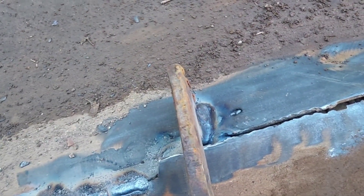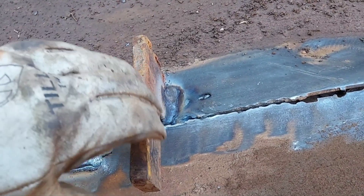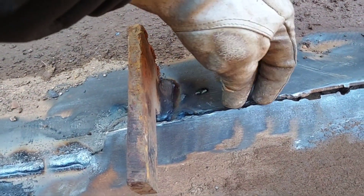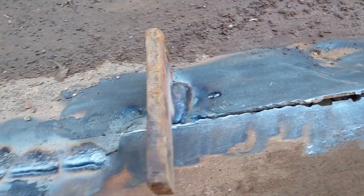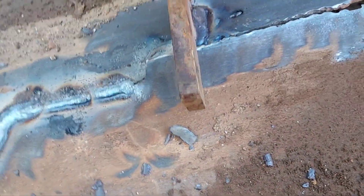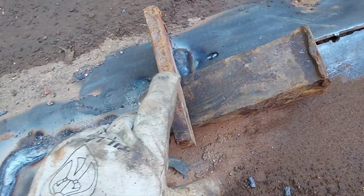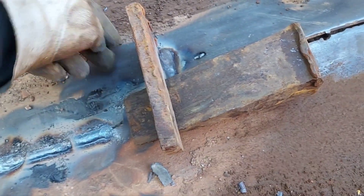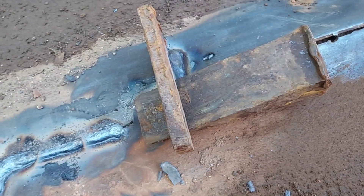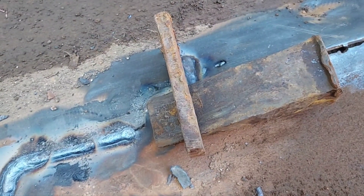You might have been wondering what the dog and the wedge was all about. The dog goes there. That piece of plate is lower than this piece of plate because of this giant dent right here that you can't really see on camera. What you do is weld the dog to the lower plate, then stick the wedge in that gap, and as you weld on that wedge it's going to create pressure between the bottom of the dog and the top of this plate, and bend the top of this plate downward to make them at least closer to being on the same plane — it should make them all the way on the same plane. Anyways, that's the dog and wedge method, and it works very well.